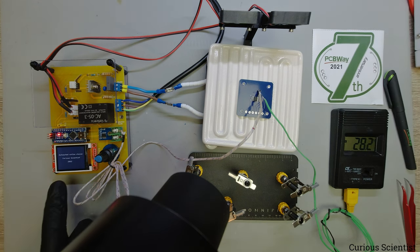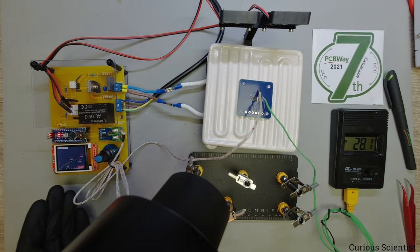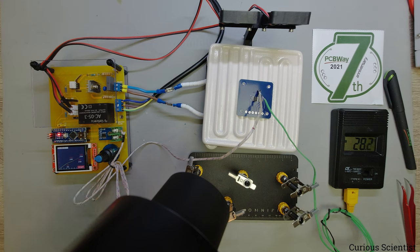The fans started and we see the welcome message on the display. The fans turned off and I can see the curve on the display - I've pre-programmed the values for this solder paste, so the display corresponds to the reflow curve for this specific material. I just have to find the start button, then start recording with the secondary camera and adjust it, then start the soldering procedure.